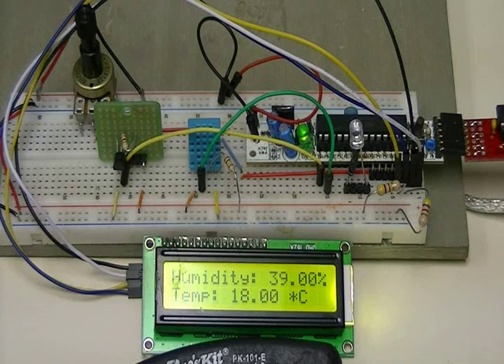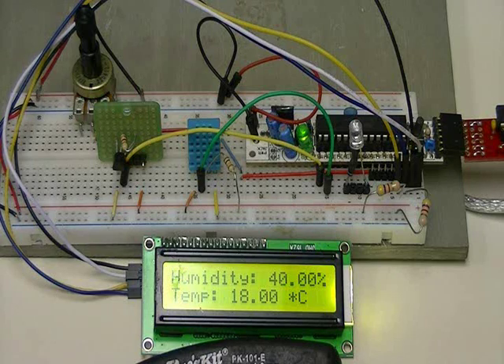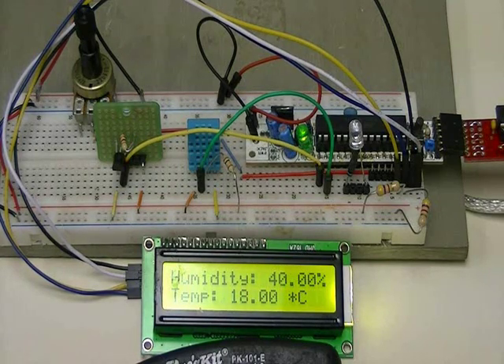Also hooked up with it is the DS18B20 temperature sensor — I just have to change the programming slightly and we'll do that in a moment. For the beginner, this is a way to get stuff really working. If you can detect humidity and temperature this easily, the applications are endless. I did a design a couple of years back for hatching chicken eggs, and I'm going to update that using the DHT11. You can make quite a chicken egg hatcher, among many other uses, including a small mini greenhouse that I'm building. When I get those done I'll be sure to film and upload them as well.